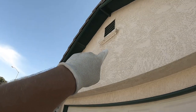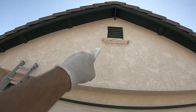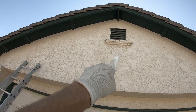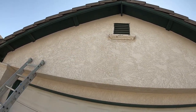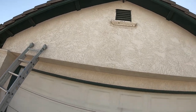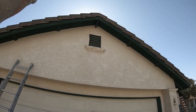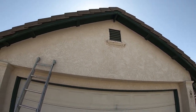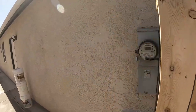However on some of these areas here - these styrofoam pop-out corbels - they're pretty damaged. The birds like to peck at them and pull the styrofoam out, so these we're gonna have to do a little bit of stucco patch. Now around the whole house there are a bunch of areas like that. At the peak of the house there's always a seam of wood - I always like to caulk that and hammer in any nails that you run into. We're gonna cruise around and I'll show you the stuff we need to repair today on day two.